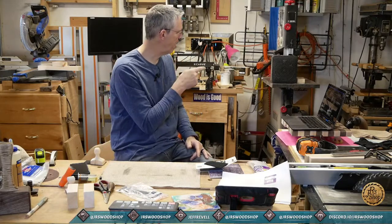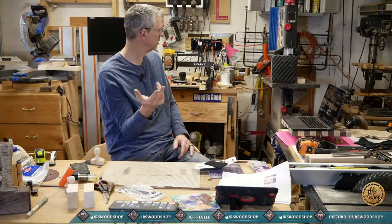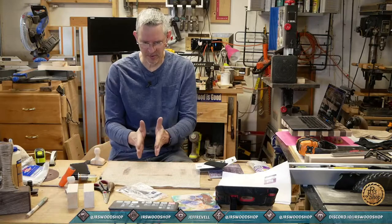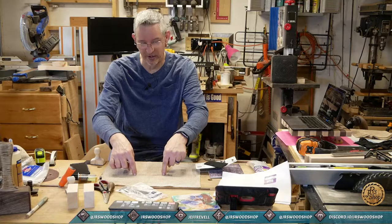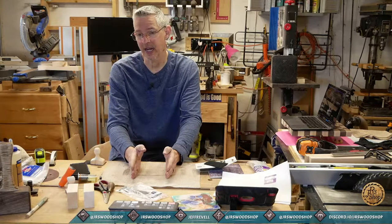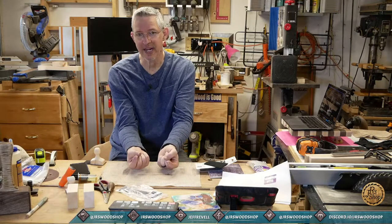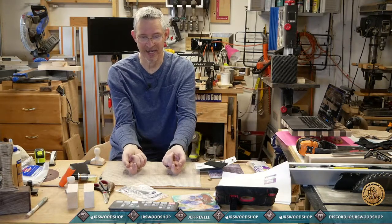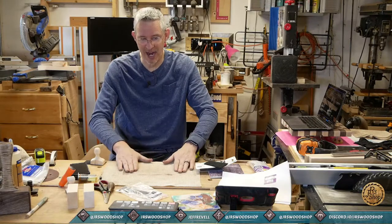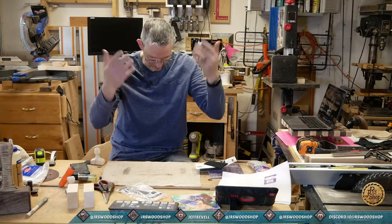The guy that I bought this jointer from made these tools. I don't know where they are, and I gotta find them. He made this tool, or tools, which was basically a piece of metal with two magnets on the bottom of it, or three magnets. I think there were three magnets on it, and there were two of them. They would basically sit on the outfeed table, the two magnets on one end and then one magnet on the other end. And the two magnets would hold it really flat to that outfeed table. Then it extended out over top of the blade, the little blade, spindle, drum, whatever you want to call it. And the little single magnet would then hold the blade right up against it. The very cutting edge of that blade is held by the magnets. And because those magnets are set to the same height as the two magnets behind it, you would get a very perfect level for that blade, and you tighten the screws down and Bob's your uncle.